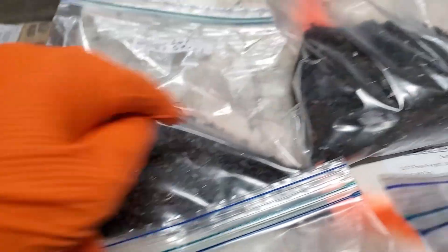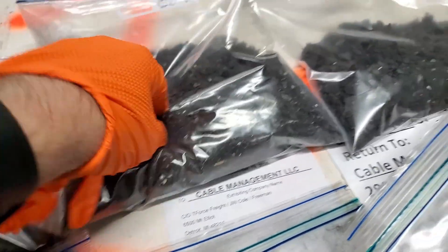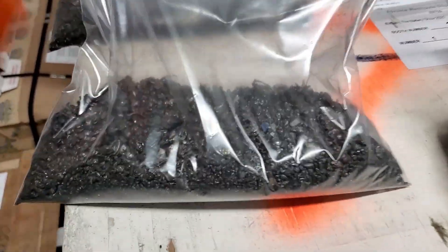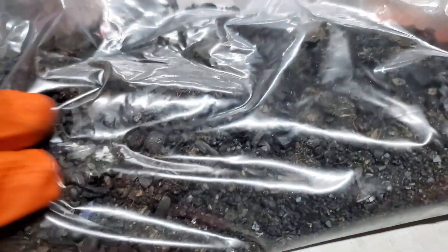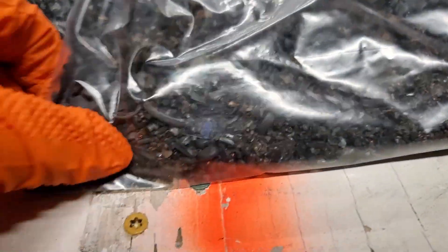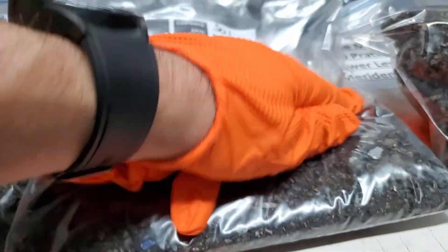So we have the steel, then we have the dense material — in here you can see some brass pins and some plastic — and then we have the fluff, so this bag is super light. And then up here, same thing: the steel, you can see that's very clean steel, and then we have the dense fraction. You can see it's a little bit plastic and then a little bit of non-ferrous, some brass pins — not a tremendous amount, so I'm not sure how much value we would get by putting this on the air table or on a wet table.